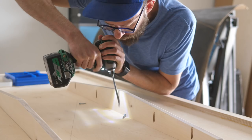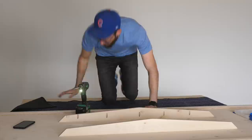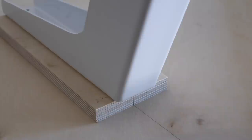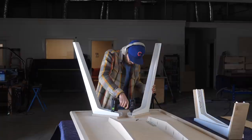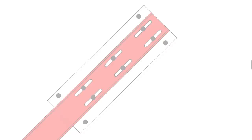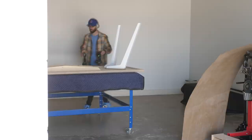We've already done most of the work when it comes to attaching the belly pieces — at this point just position them to your marks and attach each with five screws. The legs are kind of similar. The trick is to line up the marks on the center of the ends of your plywood spacers with the 45-degree marks from the corners to ensure the legs are at the proper angle. Then attach using one and a quarter inch long screws through the slots, through the spacers, and into the underside of the plywood. From here, use whatever finish you like and then you're done.